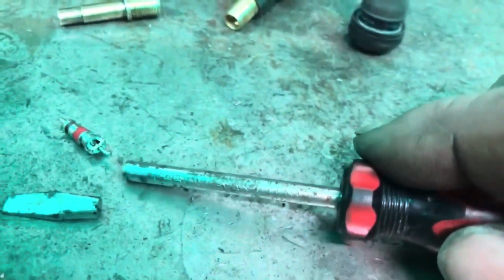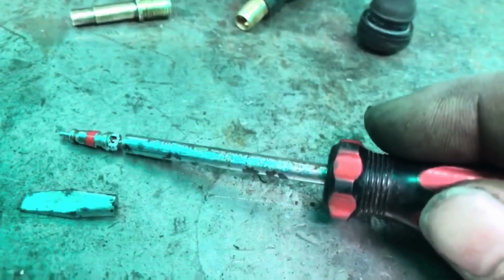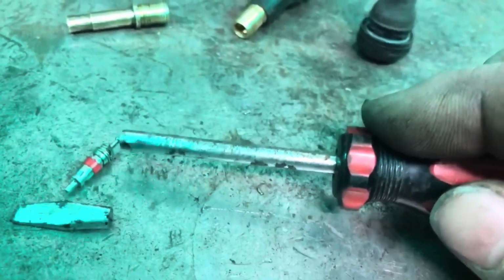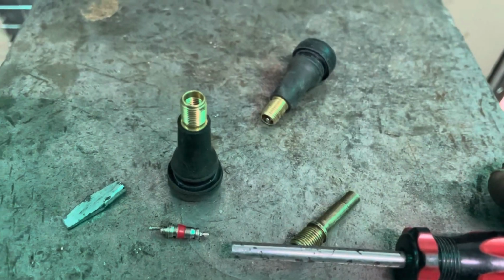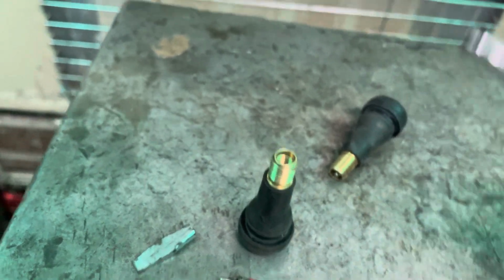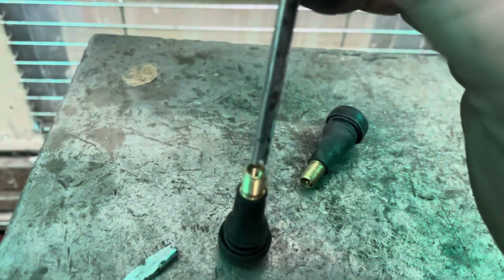Okay, so that's basically where that valve comes up. That hole is so that you can actually go over the valve. The next thing is to cut a slot in it to be able to undo the valve. I'll show you what that looks like in a second. Now, after doing all that hard work to make sure that the slot fits over quite nicely, you want to make sure that this now fits in here, which this only goes halfway down.